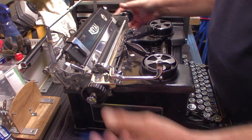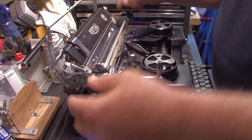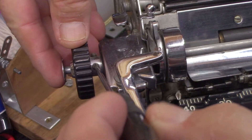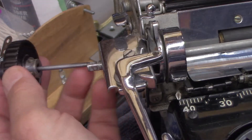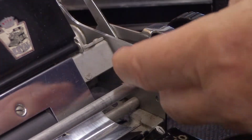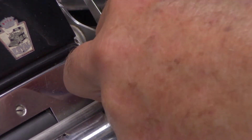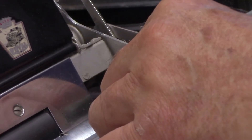Here is the machine. Going to have to pull out the platen rod. You have to loosen the two set screws on the left platen knob sufficiently, and the platen knob pulls out along with this little shaft — that's part of the line spacing clutch. Then on the right side there is a set screw that goes into the shaft. We want to take that off and of course not lose it. And we should be able to pull this shaft out to the right like that.